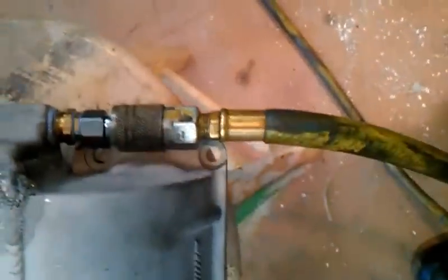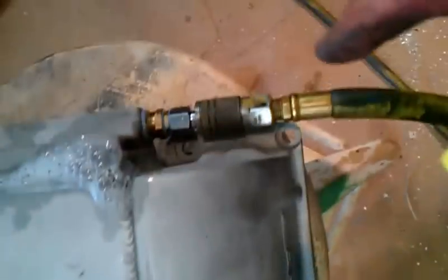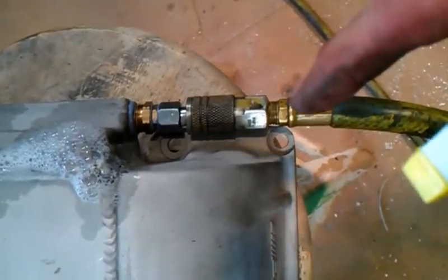Being the first time around, you can look at these things and never see a pit. So there's definitely a leak on that side. Basically, what I'm doing is pressure testing the thing with 25 psi. I've got a petcock over here to open it up, and I've got an air source over here.